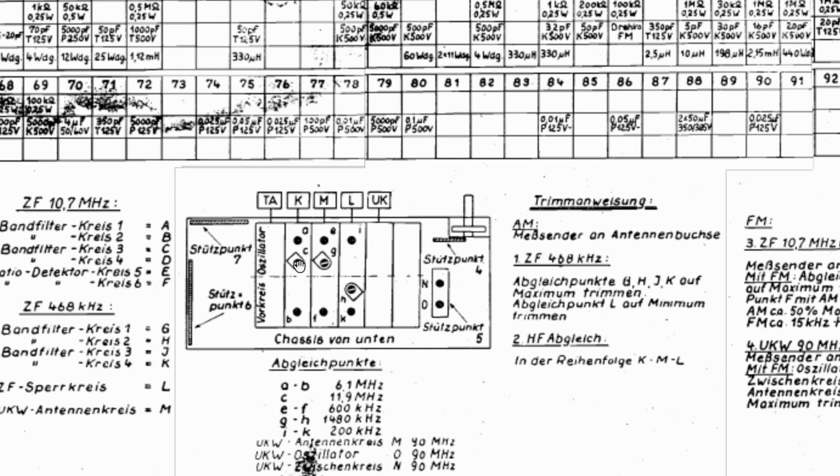megahertz and adjust C. Now these two guys are coils, and this one is a capacitor. These both adjust the oscillator so that it matches the dial pointer. And what I like to do is actually adjust the bottom end with A, adjust the top end with C, go back and forth a few times, and then adjust the peak reception to make sure that we've got the antenna circuit perfectly tuned. So that'll be the first step. That'll take care of the short wave.